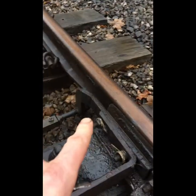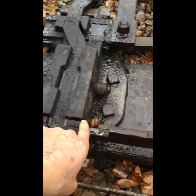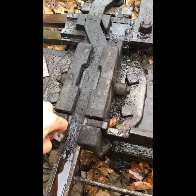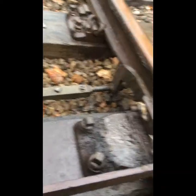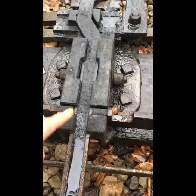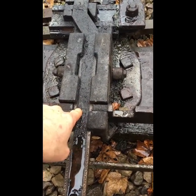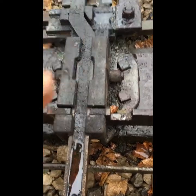Close your points up. The reason for that is, if you don't put 1.5mm in on a very hot day, these switches expand forward, and when they expand forward it will push tight and you'll have no clearance at all — a very tight lock, which you don't want. So 1.5mm gives you your adjustment. Push your lock up by hand and it will bump against the bar because you haven't cut the notches out yet.